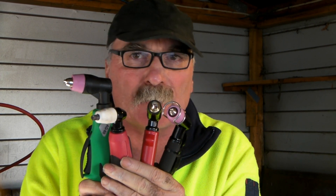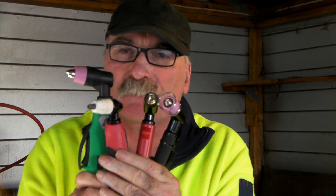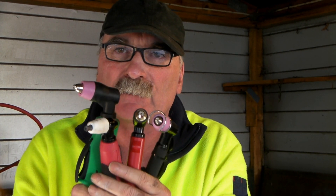So guys, if you're using any of these Chinese plasma torches, remember this little thing can just irritate the crap out of you. Just watch out for those swirl rings because all these torches have got different sorts of swirl rings - even though you might not think they have one, there'll be one in there. Just make sure you don't get any cracks in there because it can save you a lot of time and grief. Anyway guys, subscribe, drop me a like, drop me a comment. See you next time, bye bye.